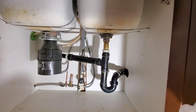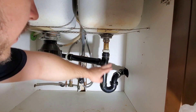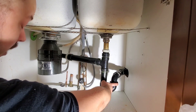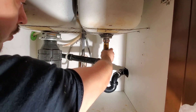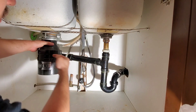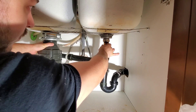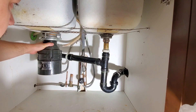Alright guys, this is our current drain. The way it's set up is we have a slip adapter horizontally, one vertically, and then our union nut for a trap. When you want to take off this drain assembly you have to undo this, take this off, and take this off. You have to pull this down while moving the garburator back to get this out, and when you're doing that you're moving the cup drain back and forth — and that's why I have a leak here again.